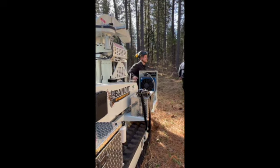We're going to supply you with this tool here. It's a two-sided tool, so you have belt tension check on this side and then an anvil setting up here, which we'll get to later. This tool is simply going to go into this hole here on this belt guard to get a feel for how tight that belt is. This is nothing more than a shiny sales object, guys, but it is a useful tool for a quick guided check to really follow manufacturer inspections.